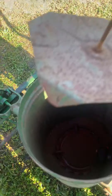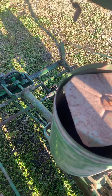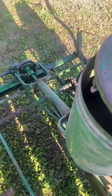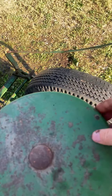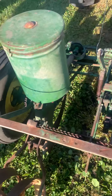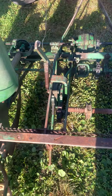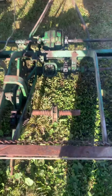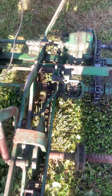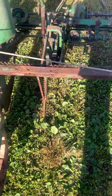I planted some sweet corn with this. You have to find the right plates — I'll try to put in the description what plates I'm using. If you buy sweet corn from a seed dealer they'll tell you what plates to use, but the stuff I bought didn't say. You can just try plates until you find the right one that fits so the seeds fall in properly. Mine's not set on check — it's set on drill. The check setting was for the old check wire system so you could cross-cultivate.